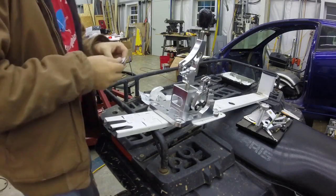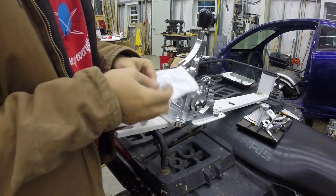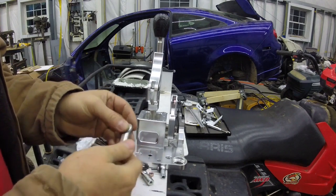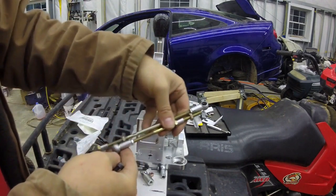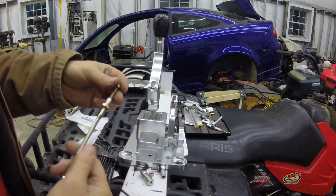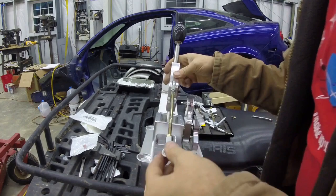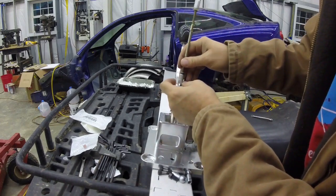I got my new parts in. The first are these 6mm diameter shoulder bolts with 5mm thread on them — made for 6mm, right bang on. The reason I got a left-hand threaded one is these are the two arms that came with the reversers, and one end connected to the plastic is left-hand thread. I'm going to have to remove a bit of material there because it's lifting up — this is just too wide. A little bit of grinding.